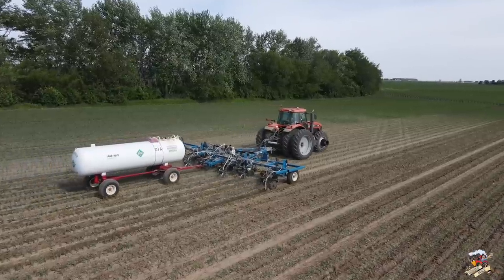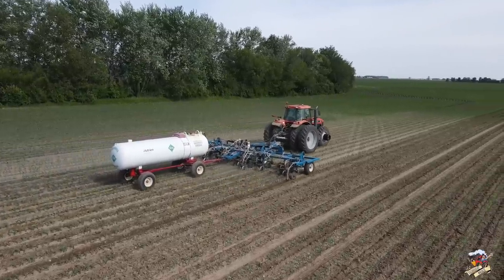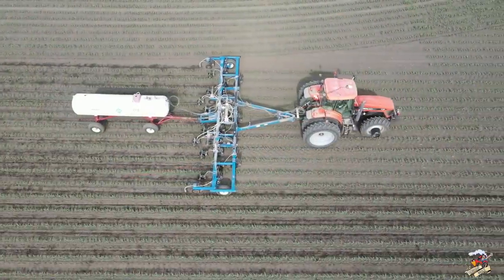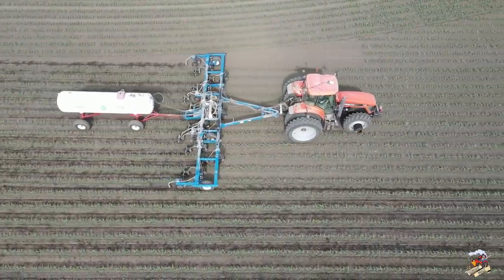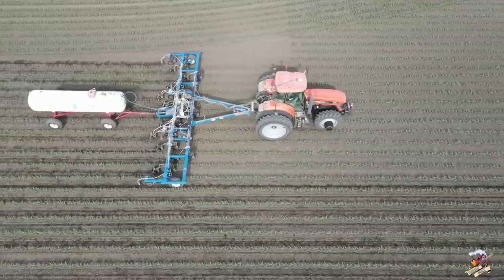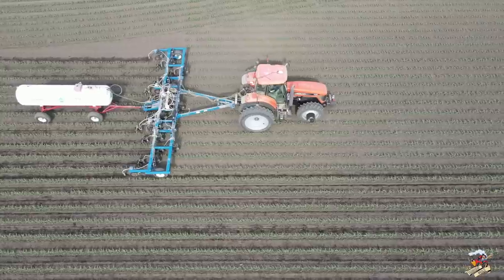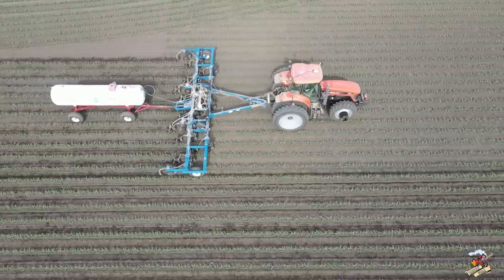This anhydrous applicator you see has the knife that's putting the anhydrous down and also has the discs to help cover that where it's cutting into the soil to seal that anhydrous down in the ground. But you might see a little puff when he comes to the end of the field and lifts the applicator out of the ground. And then some guys will use what they call a sprayer applicator, side dressing corn that way